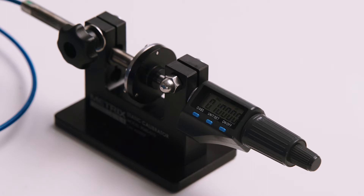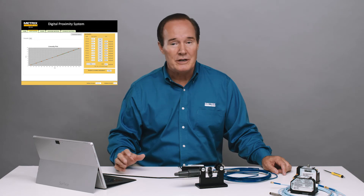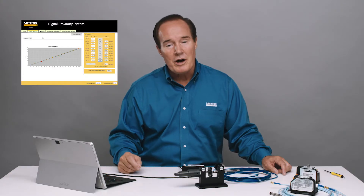We'll take our last data point and we'll see that it's very linear, and our incremental scale factor is between 190 and 210. It only had to do that between 10 and 90 mils, but we've got the full 80-mil API range within those limits, so that's very good. Let's take a look at deviation from straight line — that looks very good. It's between 1 and minus 1, and that's where we need it to be. All the limits look good, and that's what we wanted.